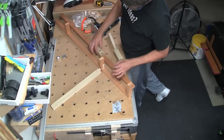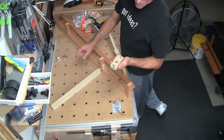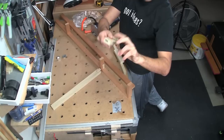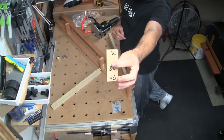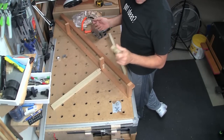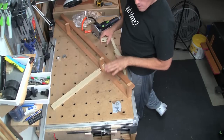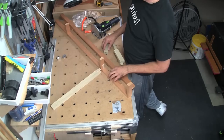For placement of this mortise, even though this is inch-and-a-half stock, I can use the different size spacers to achieve the offset. Using the one-and-three-quarter-inch spacer on inch-and-a-half stock, you can see how offset the domino mortise becomes. Using the two-inch spacer, the offset moves it even further to the opposite corner. This lets me do these offsets without having to mark pencil lines. Just use a reference block to make sure none of your sizes are going to blow out the side, and you're ready to go. None of these are going to be centered — they're all going to be offset a little to give as much wood in between as possible.